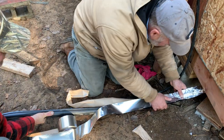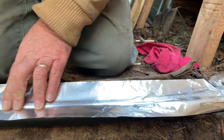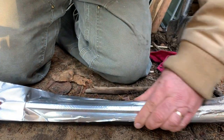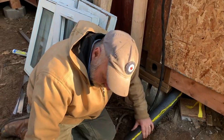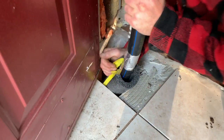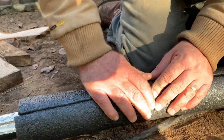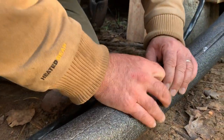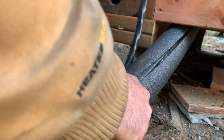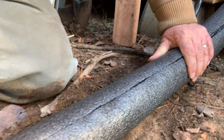We're going to continue this operation all the way along and then switch to the foam. We've got the pipe insulation on here and it's going right up into the building where it's going to be heated. This will all be encased in protective pipe later on. The foam insulation goes up on top of the pipe — there are self-adhesive strips that you pull off and it seals together. It's going to be encased in pipe to protect it, keep it from getting chewed on by mice and deteriorating.